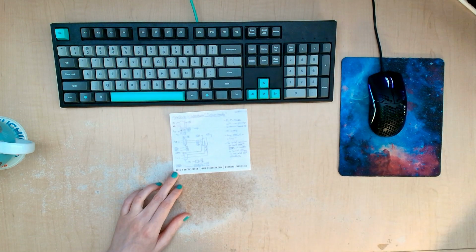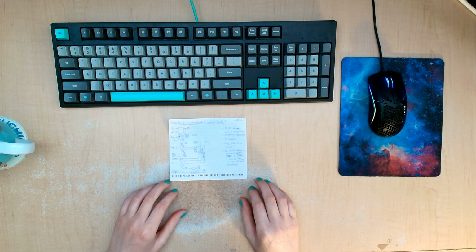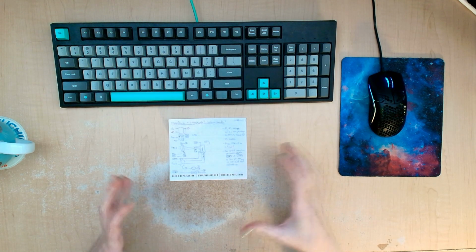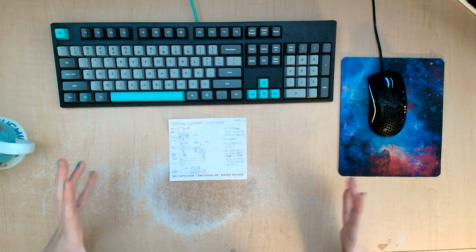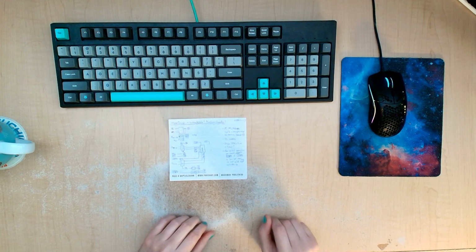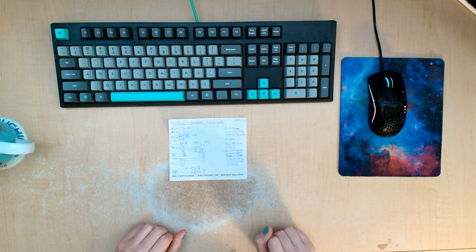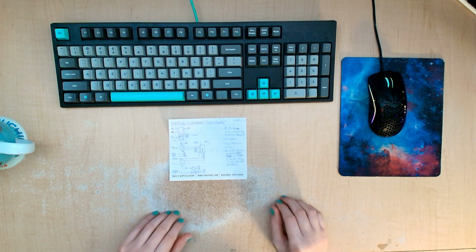But SDRAM is a lot more complicated to control. So that pushes me into an FPGA or something like that to talk to the RAM. And that kind of balloons into a very complicated card. So I figured, well, I'll do that eventually. I'll be able to have a whole bunch of memory in the system by making that card, but it's going to take me about a month or so to do.